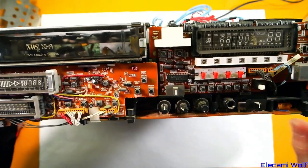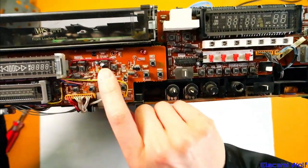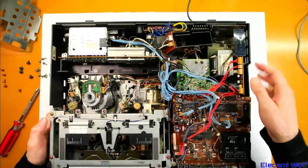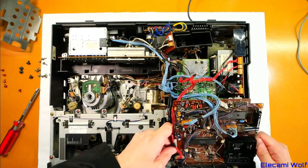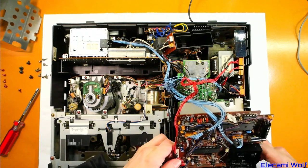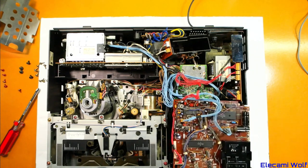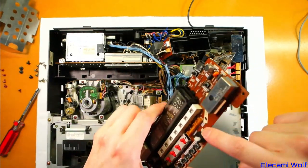The timer board there — I don't think that has any extra screws so once this one's lifted up it will come out. This one here has two red screws that have to be undone and then it's joined to the bottom board, so they'll have to be taken out to unfold the bottom board. All the cables to the bottom board are done down here so it can fold out fully, and these cables here are fairly long so it can be released without having to undo anything. These clips just need to be pushed in. There are some connectors to undo at the front which I think are the audio selector things.